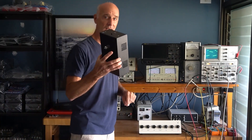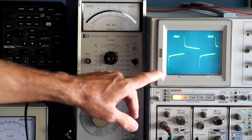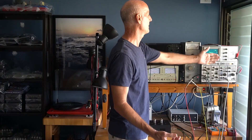Let me show you how the system works for testing — if I make a mistake building something, it immediately picks out an error. I'm going to fire up a Cornet with the wrong tubes in it, just to give you an example. It's got a 45-second turn-on delay for the high voltage. But here you can see that it's way off: there's a downward slope showing that the turnover is wrong, and then the high-frequency cut is way off. This is not a square wave — I immediately know something is wrong. So let me put in the correct tubes and see what happens.